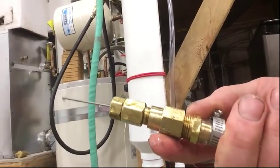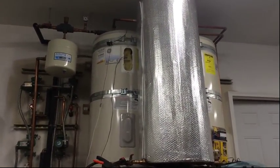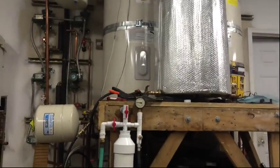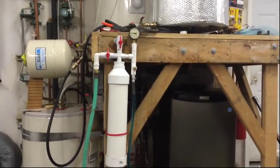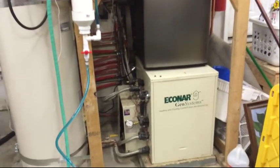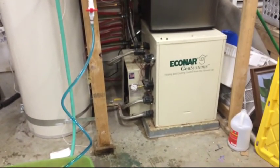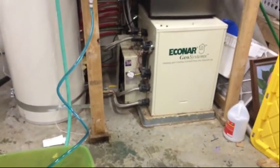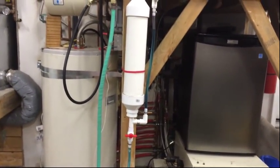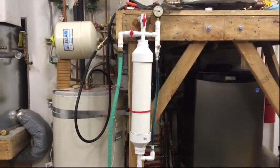Let me crank it up and we'll see how it goes. A quick overview of the heat pump system: those are two tanks that feed the hydronic floor loops. We have 10 zones, each driven by an individual pump. They sit above the beer fridge slash heat pump. That gauge down there is currently monitoring the pressure of the ground loop. I've added methanol — also known as washer fluid — to the pressurizing tank here, and we're going to pressurize it up.